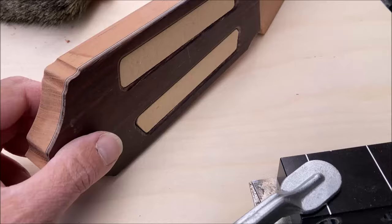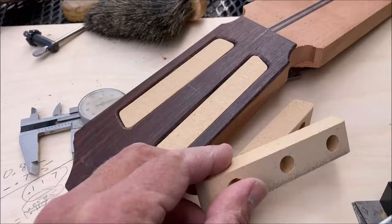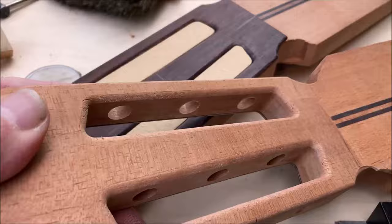Okay, so one of the first things I do is I make these spacers after I've routed the head slot, which you probably saw in a previous video. I put these MDF spacers inside here. Here's one that's already been drilled. But what this allows me to do is I get a cleaner cut in the wall of the tuner holes,